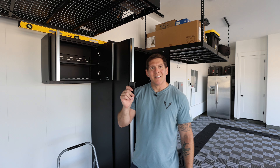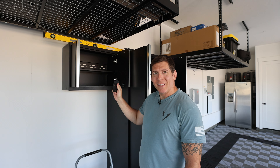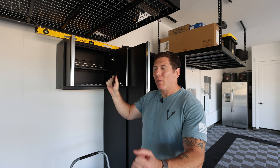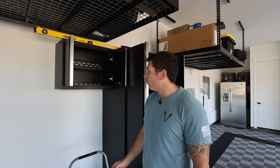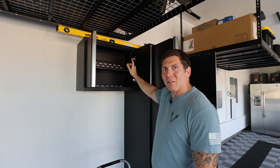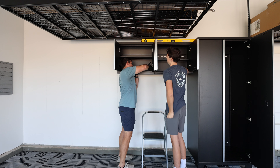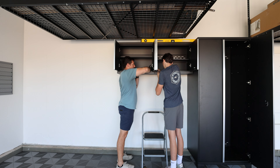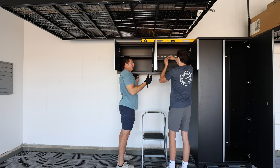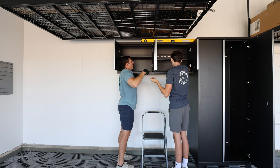We tried these brackets. I measured them, drilled them in, mounted the cabinet up there — the bolts wouldn't align, the cabinet was just a little too high. I was pushing, pulling, twisting. It wasn't going. So what me and Brody did: I held the shelf up against the wall just with my shoulders, put in bolts, and secured them. Now I'm gonna screw the thing into the wall back there, and I think this cabinet's gonna be just fine. We're level, we're aligned, and we're gonna do the next two just like that, then do the final big one in place.